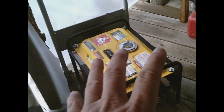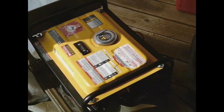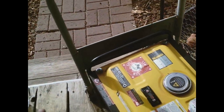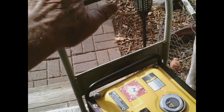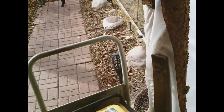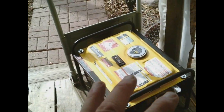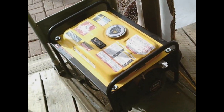You don't want to run the generator inside your porch when it's fully enclosed. What I do is open up the door, and this generator is on a dolly with wheels. I just pull it around so the exhaust blows out the door — you don't want carbon monoxide building up, especially not going into your cabin. Then it has a cord that goes into the house with a power strip, which runs my microwave inside. I can also run power tools outside.